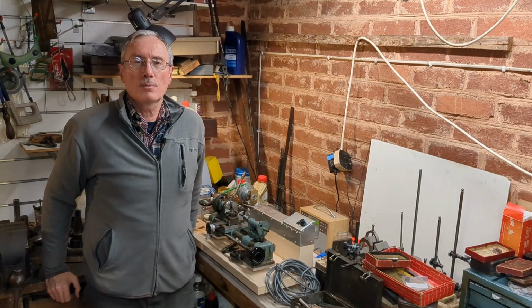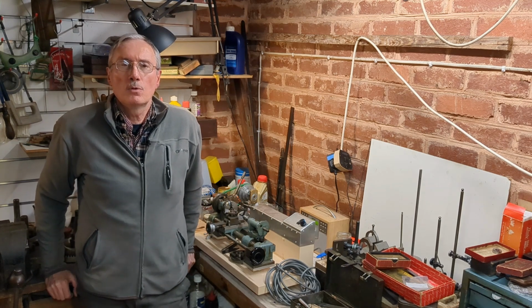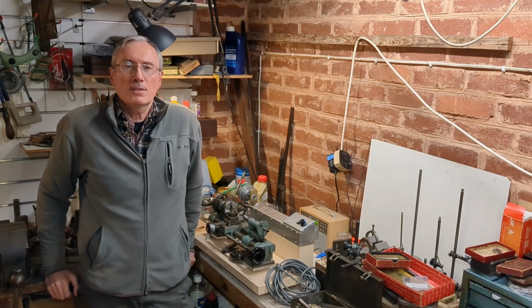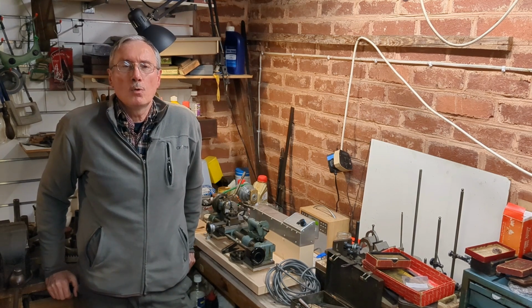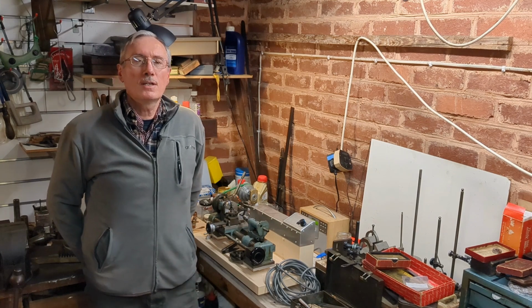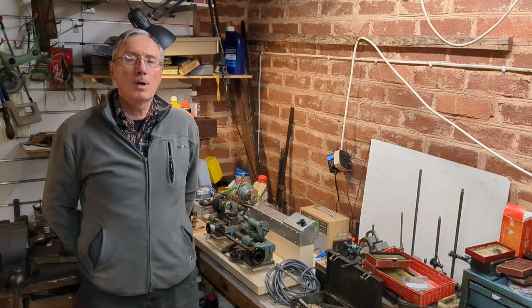Welcome back to Workshopfriend and this video number 10 of renovating my small Adcock and Shipley 1A milling machine. Last video we began to work on the overarm support casting, and in this video I'm going to continue producing the 3 bores, which have to be to close tolerance, and also their relative spacing is going to be critical too. Before we get to that, last video I calculated the deflection of the overarm support bar.